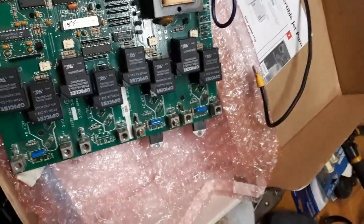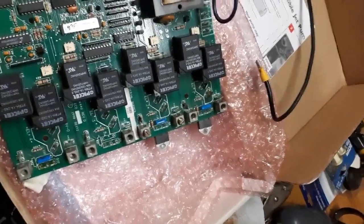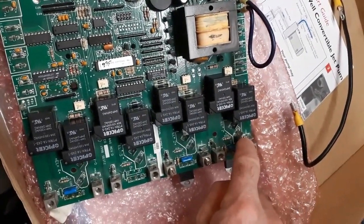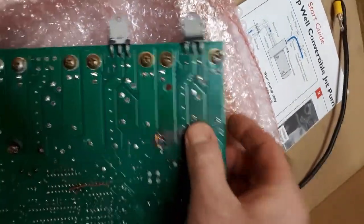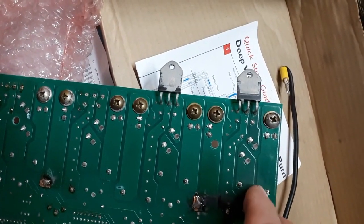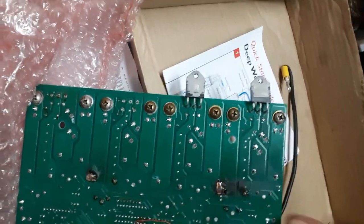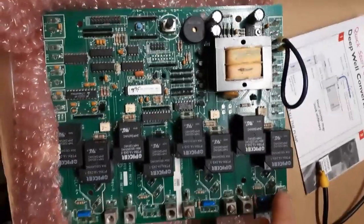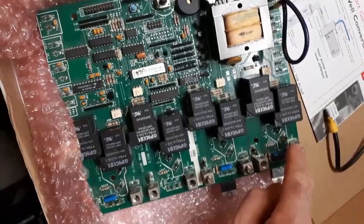So the other thing on the board in my system, and if I get any hits on this video, I can show you better on that board. But this tab right here heated up so much that on the back, where it goes through, I had to redo. So there's that connector right there, and this is where it goes through on the back side. I ended up having to make a new piece of copper for that to strengthen it because the board burned so badly. But I did manage to revive it, and that board's been in for quite a few years now, and it's still functioning, primarily due to the fact that I'm very careful to make sure those spade connectors don't have any issues.